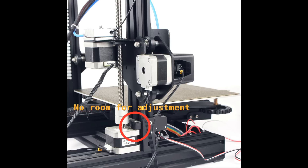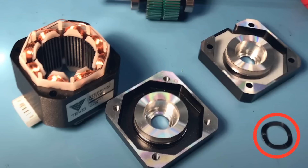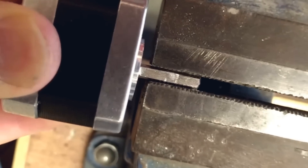Finally, the last set of problems are related to the way the Z-axis motor is mounted. The entire weight of the gantry rests on the stepper motor, and when moving the gantry up, the lead screw pushes down on the stepper motor. These motors are not designed to take axial loads, meaning parallel to the shaft. There is a spring washer inside the stepper that will compress if any downward force is applied. Not only is this additional stress bad for the motor, but because of the inconsistent compression of the spring, the layer height will again be inconsistent, further contributing to Z-banding artifacts.